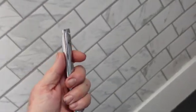So I have an idea here. Looks like I need to curve that in. I don't know, that may work. I think I need to bend this in a little more now that I'm looking at it, and see if I can get it to tuck up behind in there a little bit more. I did accidentally harden one side, this side. I didn't realize it was that hot, and I quenched it, and it made it real hard to drill. So I'm going to try to come up with a way to bend this more.